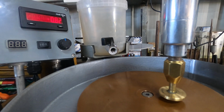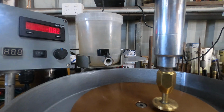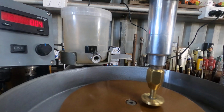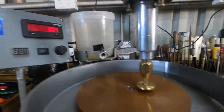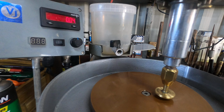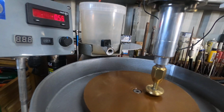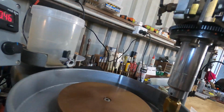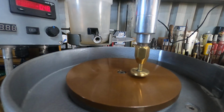Okay, so this is explained really well in George Weir's book on the VJ, which you can buy online. But that's my simple version on how you can cheat on the table, if you need to. I mean, if you maintain your alignment of your machine, quite often you don't need to cheat at all. I've got some learner cutters that come up and they say, "What's this knob here do?" I said, "That's the cheater. I've never used it." That's right, because you shouldn't have to if your machine's aligned.